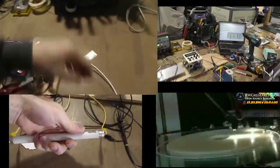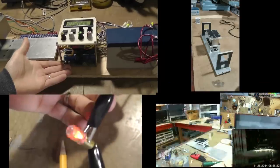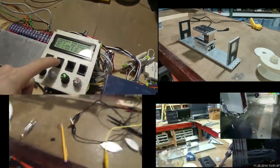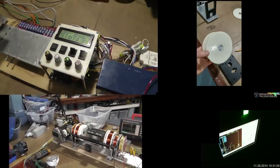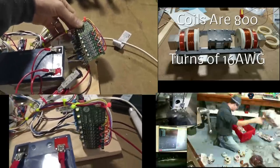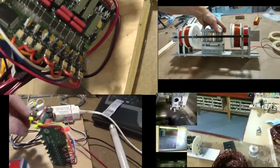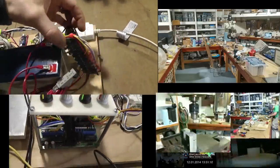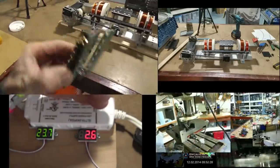Currently, I've got a power supply right here, powering all the circuitry. This is actually a PLC. I'm using a programmable logic controller for my circuitry. I have basically start, stop, neutral mode on, push mode on. Then each one of these timers is for the cycle in the system, which I'll explain in a second. The battery here is to power the big coils. This is an Allen Bradley relay circuit, which I very haggardly modified to function as an opto-isolator relay driver circuit. That was a pretty cool refurbish of old equipment that was actually thrown away. It was scrap. It looks something similar to this.